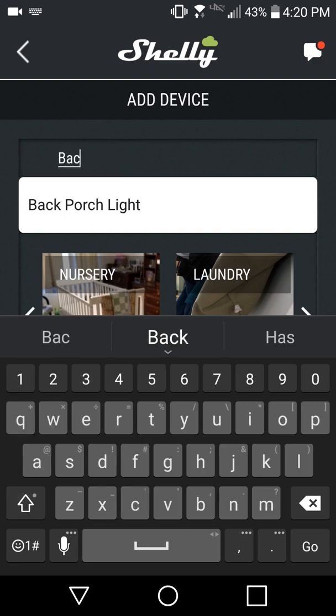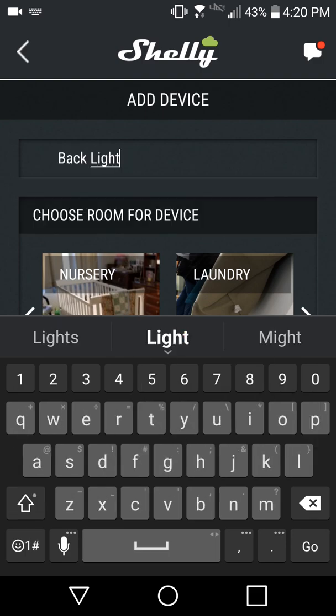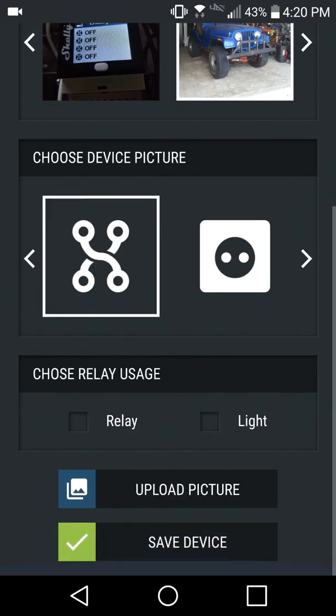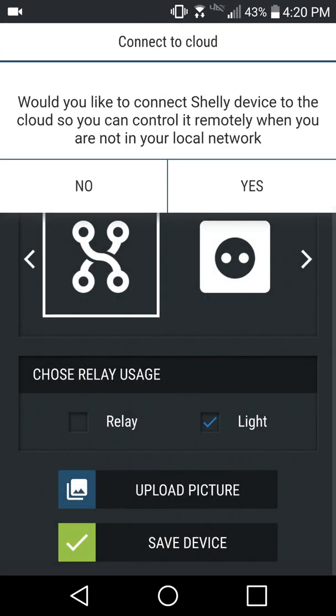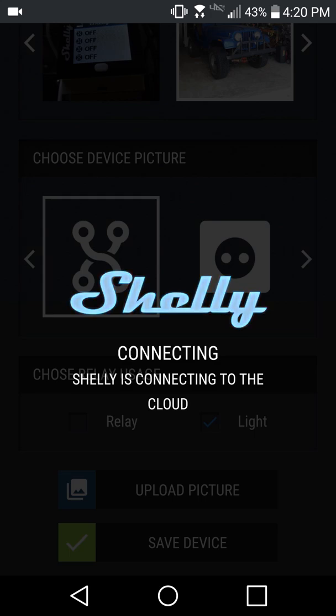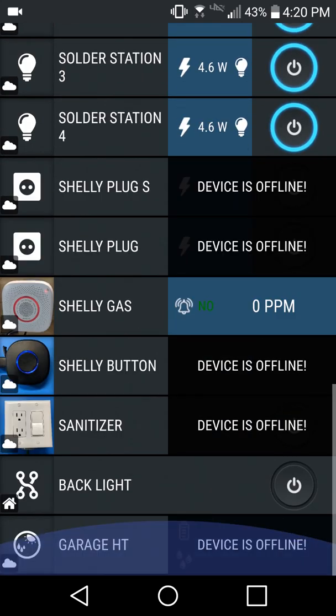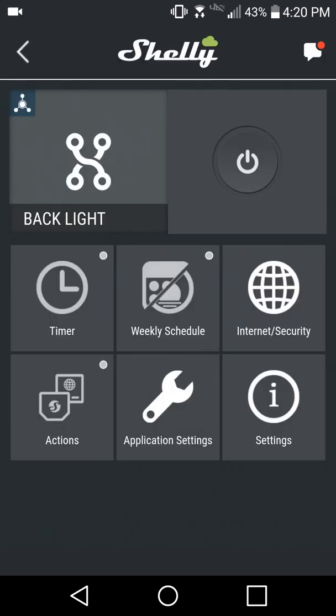In order to use the IP address method, you have to obtain the relay's IP address. If you're not familiar with how your router works, you can probably use a free network scanning app to help you get the IP address. Note that Shelly modules only work with 2.4 GHz Wi-Fi networks, so if you try connecting to a 5 GHz network, setup will fail. No matter what method you use to connect your Shelly module to the app, double check your Wi-Fi password if you experience problems. When you provide incorrect credentials, the Shelly module will attempt to connect for 3 minutes, then return to AP mode, allowing you to set it up again.